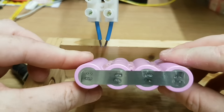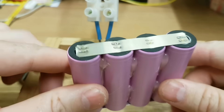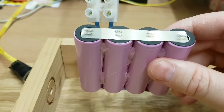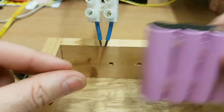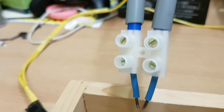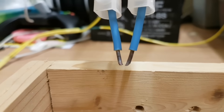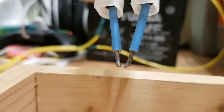Those welds are pretty good. And there you have it — there's one of my parallel packs for this 10S 4P pack that I'm doing, welded up. It's very easy. I've showed you the design before but we've got some 16mm squared cable here going into a chocolate box — we call them — basically an electrical connector. There's some two and a half millimetre copper core wire.